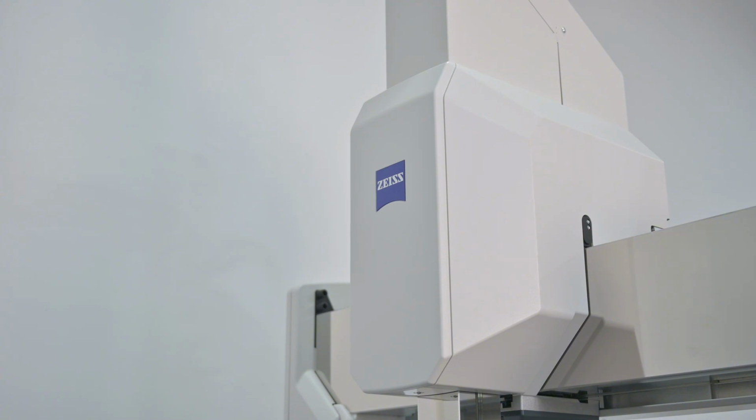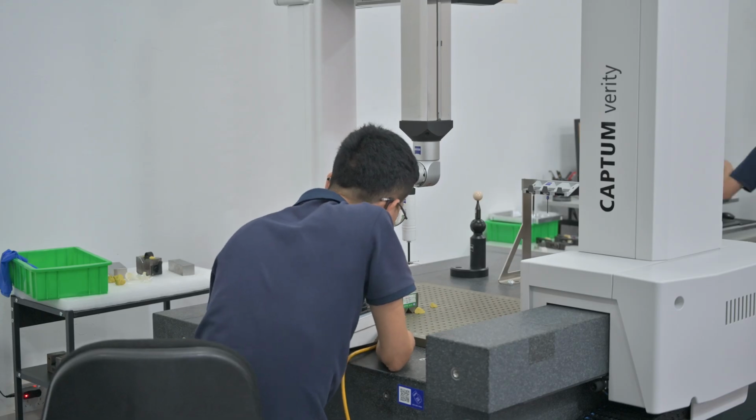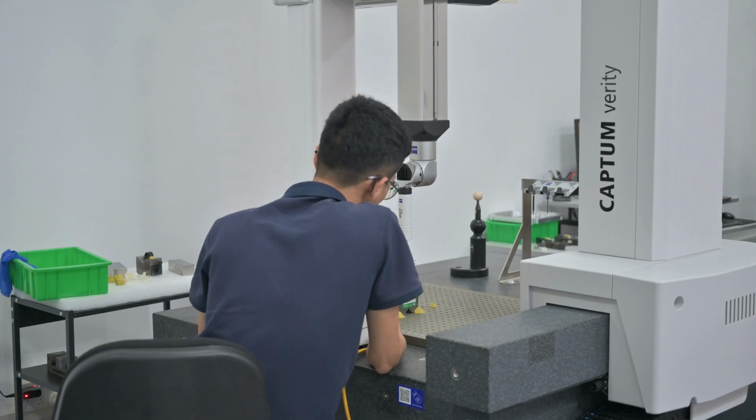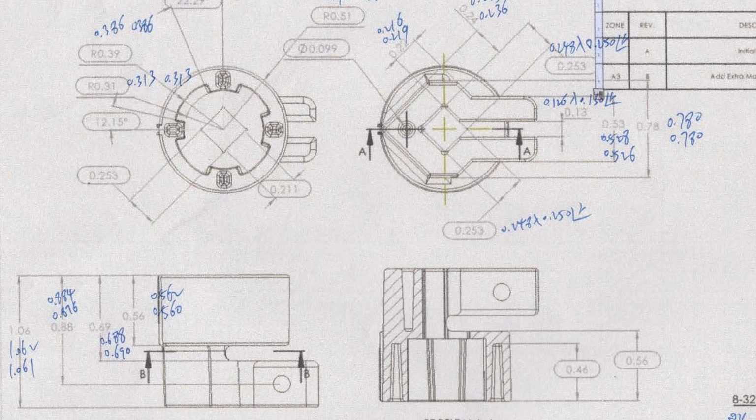Of course, even with thorough preparation and optimization, plastic parts may still gradually release stress after machining, leading to minor deformations. If this happens, we can address it with some simple post-processing corrections, such as using fixtures to flatten the parts or applying localized heat or adjustments. Ultimately, both parts achieve the design tolerances set by the engineers, and the minor deformations were fully in line with their functional requirements. It was, without a doubt, a highly successful machining case.